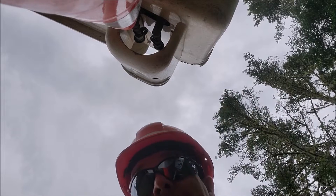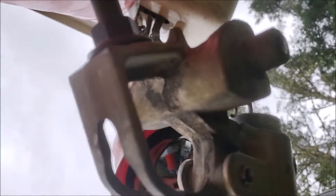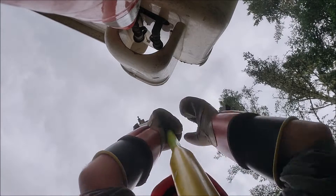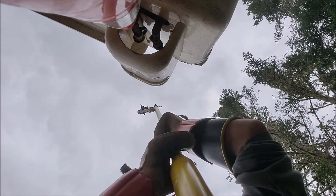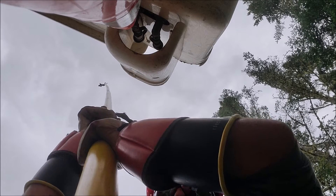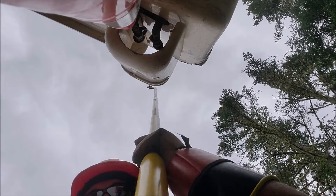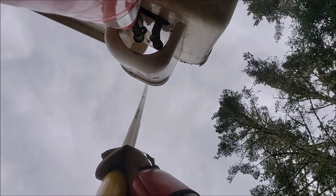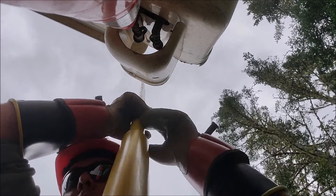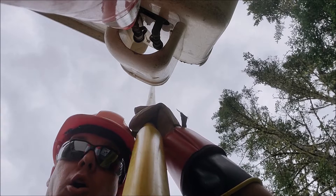When extending the stick, if you're using it to close a cutout it has a little notch the hammer slips into, so you've got weight on the end. You want to lift that straight up. If you lean the stick to the side you can see the bow in it, and it gets very hard to extend. What's easier is to look up, keep your eye on what's on top of the stick in case it falls so it doesn't hit you in the head. Hard hat always.